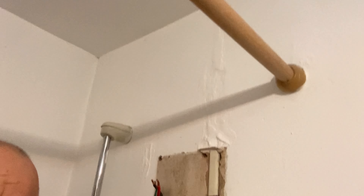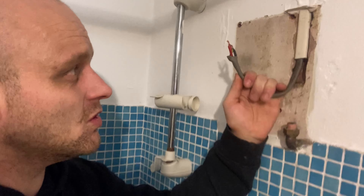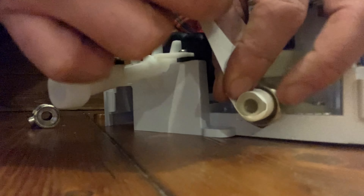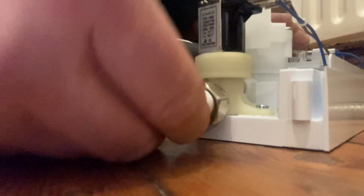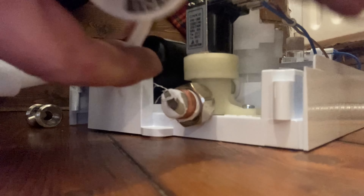I'm proper lucky on this job — the cable is in trunking and I managed to pull it down another two or three inches so I can take the supply across. Always tighten the compression fitting up out of position first. Here I'm using PTFE, and the reason I do this is to stop me over-tightening the component or the valve on the shower, because the component is only plastic.